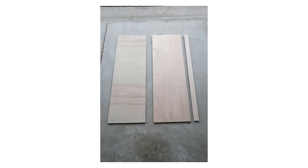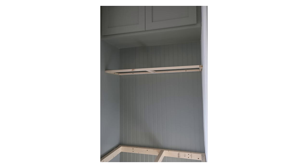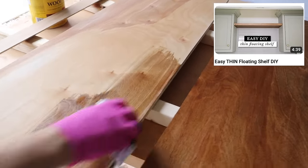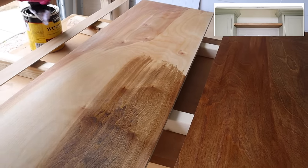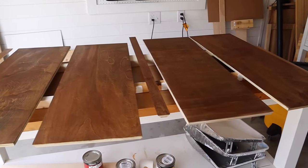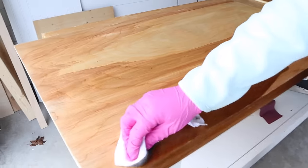For our floating shelves, we are repeating basically the same steps as our floating desks, except I'm using thinner wood for the frame to make the shelf thinner. It's similar to what I did for my thin DIY wood shelf for our laundry room. I have a step-by-step video tutorial for that that I'll link below. But I am using 1/2-inch plywood for all sides of the shelves, which is a little different than I did on my laundry room shelf. And I'm also beveling the front edges, just like I did for the two desktops.